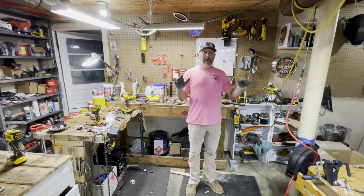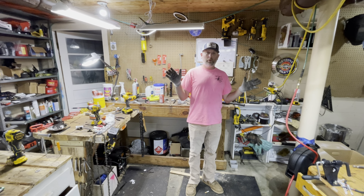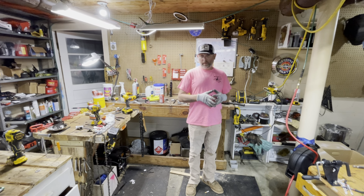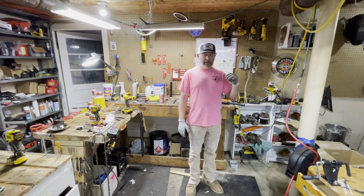characteristics. Every chain I put on, you run it a little bit, the first initial put on, it stretches some, you know, it stretches a little bit. And at least for the gauge I'm running, I'm running 050 gauge, and the lengths I'm running, the biggest I run is 32, and I do have a 3-footer, but I hardly ever run that. I have run it some, but what I'm saying is, for that kind of cutting, that size chain and everything, the Holzforma chain, at least the full comp, full chisel, it acts just as good.